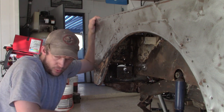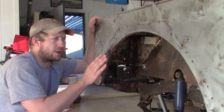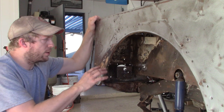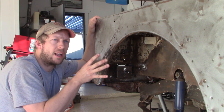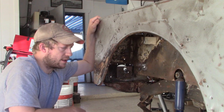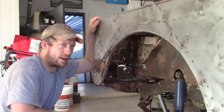Typically you use a dolly, which essentially goes on the back side of a panel if you're working on a curve. With this being flat, I'm going to use my channel iron, and I'm going to start with that to try to see if I can bring this to a place that is flat. So let's get started, and I'll just roll the footage while I try to get this level.